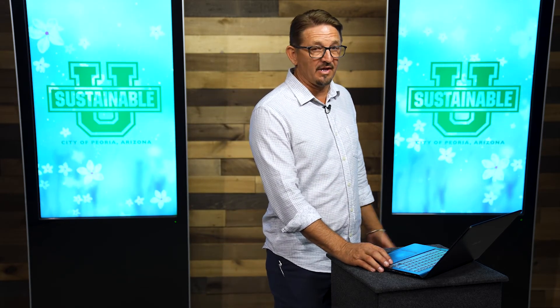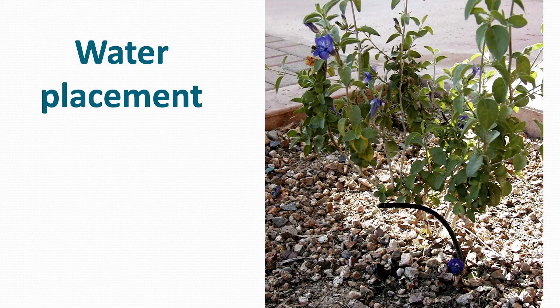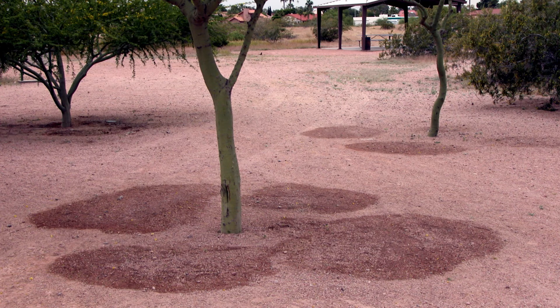As the shrub gets bigger you spread it out and put more drip emitters out there. Here's a good example of getting the whole area under a pretty good-sized tree wet — there are four drip emitters with heavy enough flow to make a big wet spot. That's about as good as it gets with drip irrigation: the whole area underneath that tree with four wet spots covering it.